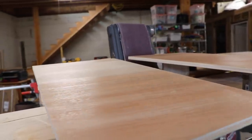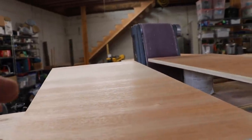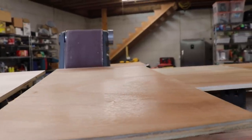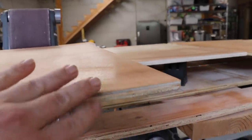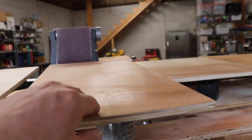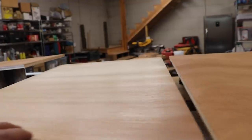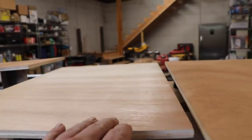Before I do that, I thought I would share that I spent a little extra time sanding these pieces at the 220 grit level, just out of curiosity to see if I could one step sand and get a nice even finish. And I think the answer is yes. I think what happens is I don't put enough pressure out here on the edges as I'm sanding, because I'm afraid of sanding off this edge. And so you end up with a roughness around the edges, and it shows when you go to lacquer. The lacquer just is more dull around the edges. Of course, there's grain involved too, so that's a factor, but I feel like spending that extra time to make sure that I got the edges nice and smooth paid off in the lacquering.